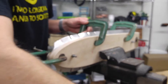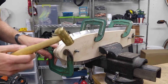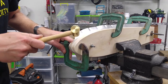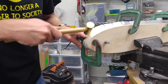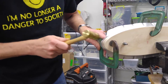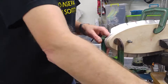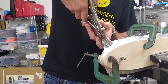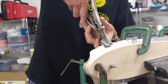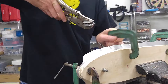And that's about as far as we're going to go there. Then we're going to work on this leading edge radius with this little brass hammer. You do it a little bit at a time. And now we're going to deepen these flutes just a little bit — come back in the original locations and squeeze them a little more.